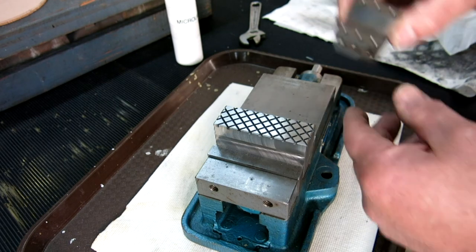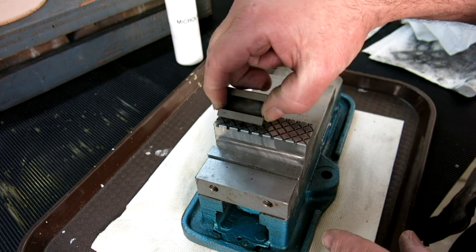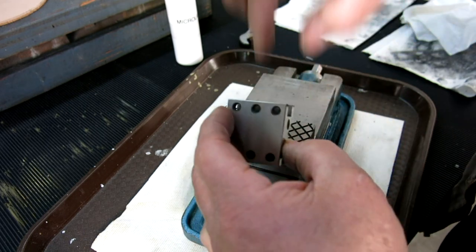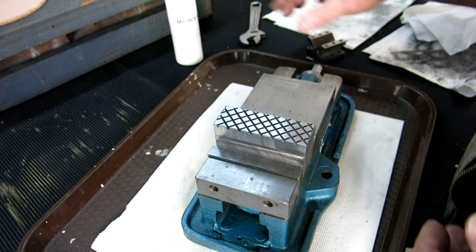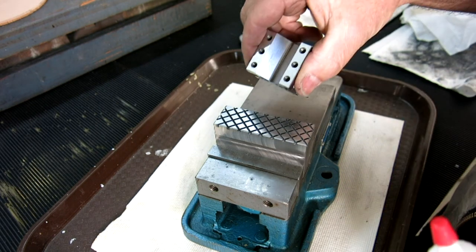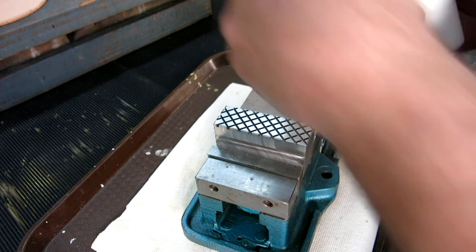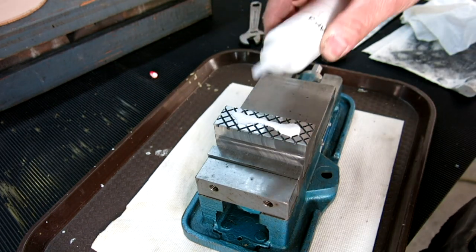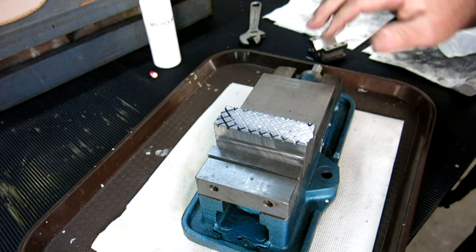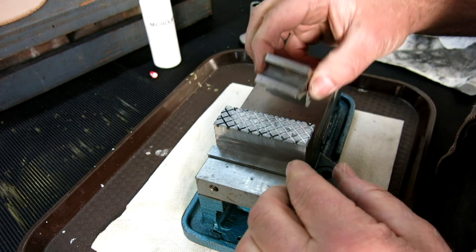Here's our V-block and here's how we're going to address the lap. I can turn this around to use both sides of the lap. I really want to concentrate on down pressure, one side at a time. This is a three-micron abrasive — it's pretty fine, and the grind is pretty fine too. This is an aluminum oxide slurry and we're just going to give that a go and see how it performs.